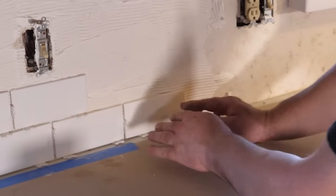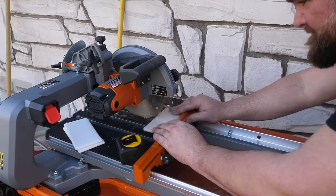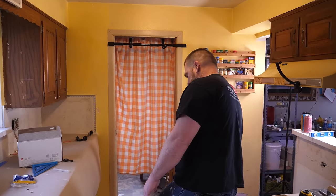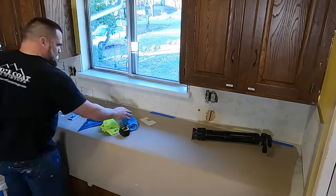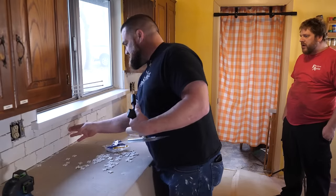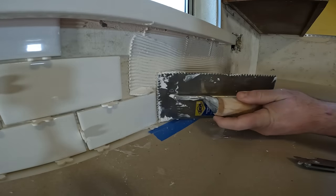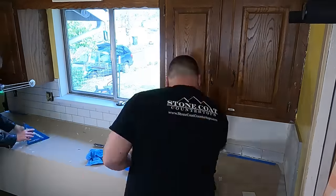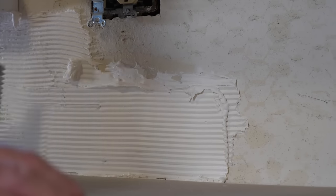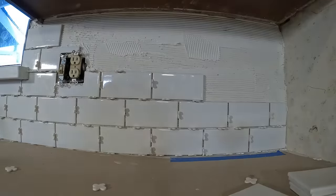Working our way down, we'll start flying now. The technique is called back buttering — add some mud to the wall, mud to your tile, and it almost suction cups. These are solid. Use the little X spacers to keep the spacing. Tomorrow we'll come back with the grout. I was here till about 6:30 last night with my tunes on. I'd never done the tile trim this way before, tried a couple of methods, YouTubed it, guy taught me, ran to Home Depot, and did it like a pro. YouTube teaches everything.